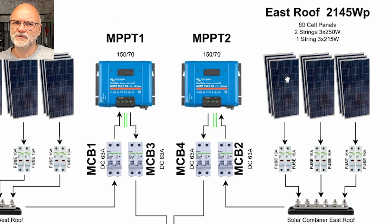There's some oxidation on the bus bars as well, some black stuff which wasn't there before when I set them all up. They were all blank and shiny. And I think it only gets worse now. So we will have to see what is going on with these panels, but I think they have to be replaced soon.